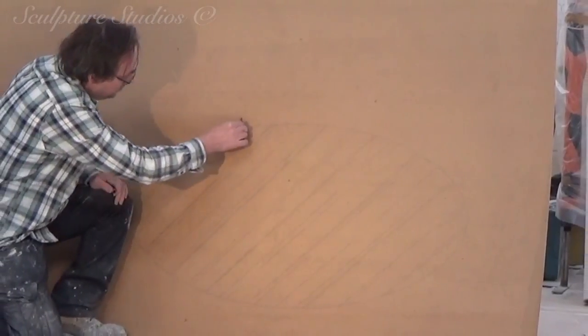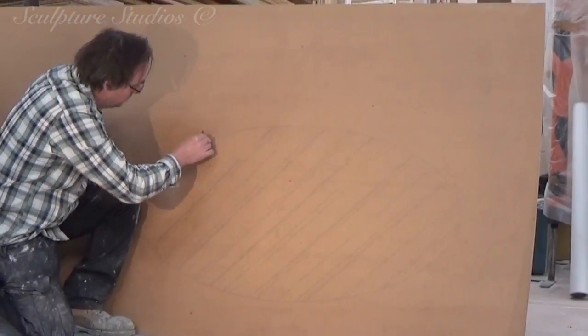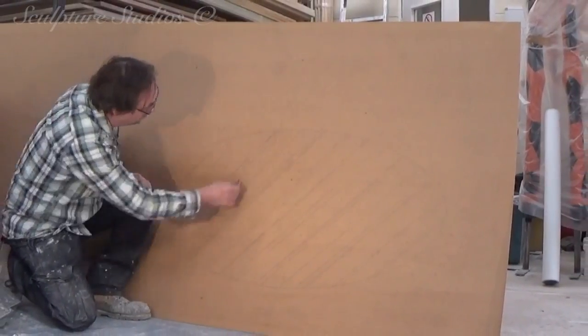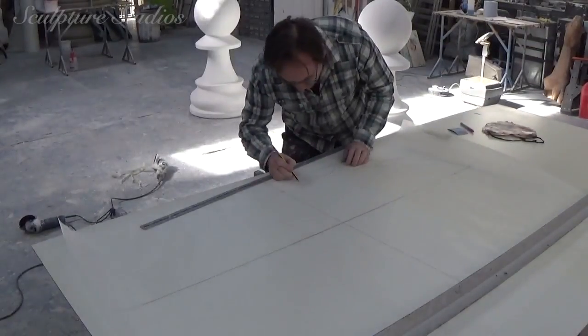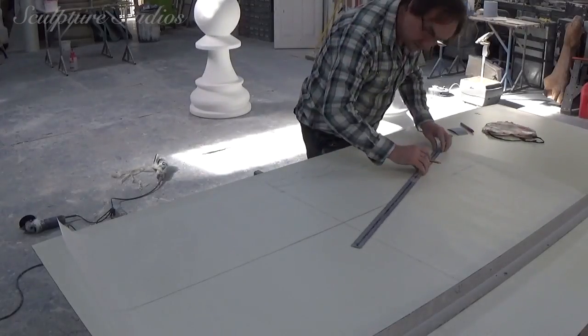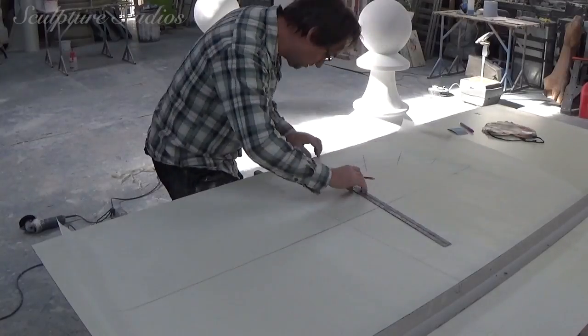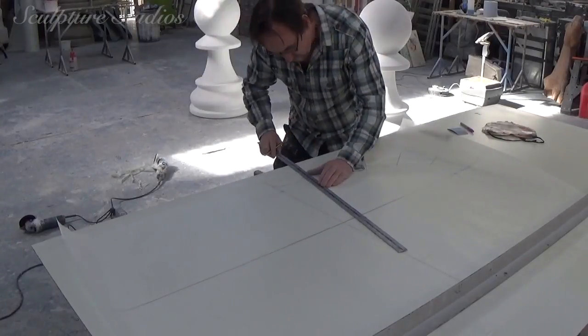The design is an oval shape from plan view with scalloped, scooped out sections all the way around. Though we are carving this by hand, we need to ensure that this has a perfectly flat, smooth top, so we're using MDF to begin the sculpture. This MDF top also doubles up as a template to show where the scooped out sections are going to be.